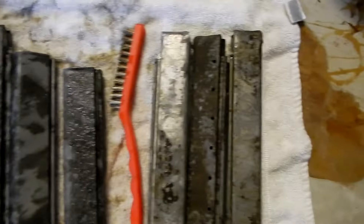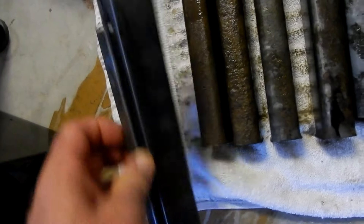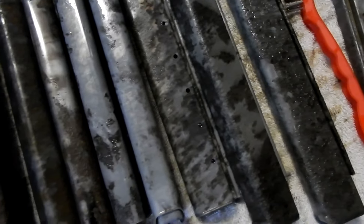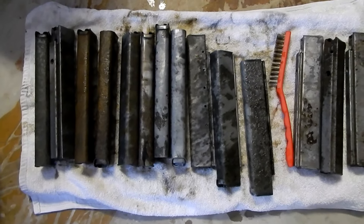The magazines to the left of the red brush were all sitting in the Evapo-Rust. I had a lot more of that so I was able to distribute it across a three-and-a-half gallon jug and put some in a Cambro. The WD-40 in the other can just wouldn't let the liquid level come up high enough to cover them all unless I only had a few mags in there. They're pretty much the same across the board, but the ones that were lightly pitted are coming out pretty good. The ones that were heavily pocked with rust are not. So I'll continue to work on these — scrub them up, arrest any further rust, rinse them off, dunk them in regular WD-40, let them sit while I'm gone for a couple of days, come back and hit them again.